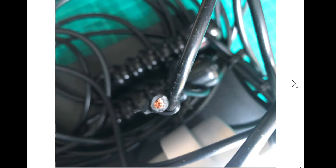Just one thing to note: in the packaging you do get what they call self-melting tape, but it's actually self-amalgamating tape. You do get some of that with it. I suggest you make a point of covering the ends — you don't want any capillary action going off and moisture getting in there. That's the lug end — a good solid fix, but not the way I would do it. I think these are mass produced, but there's a way of moisture getting in there as well, because it's not soldered into the lug either.